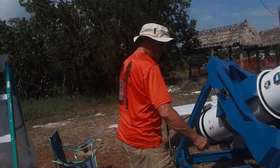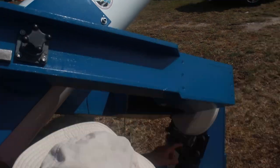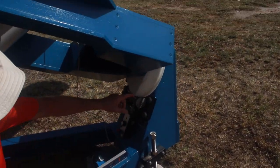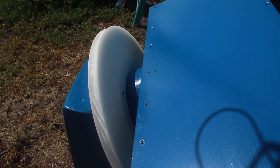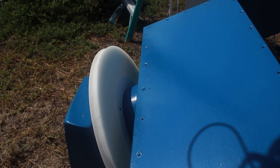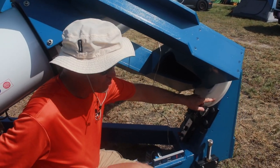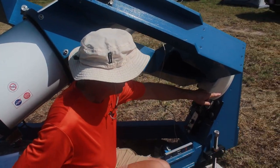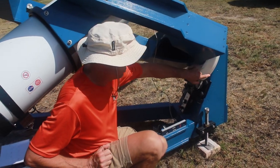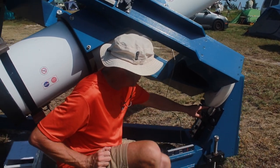The motor drive is all homemade. This is a Delrin gear that was machined out of a square piece of stock — flattened, then put on a CNC to cut around the profile, and then there's a way you can use a spirally-fluted tap on a lathe to machine the teeth. The worm is machined out of stainless steel.